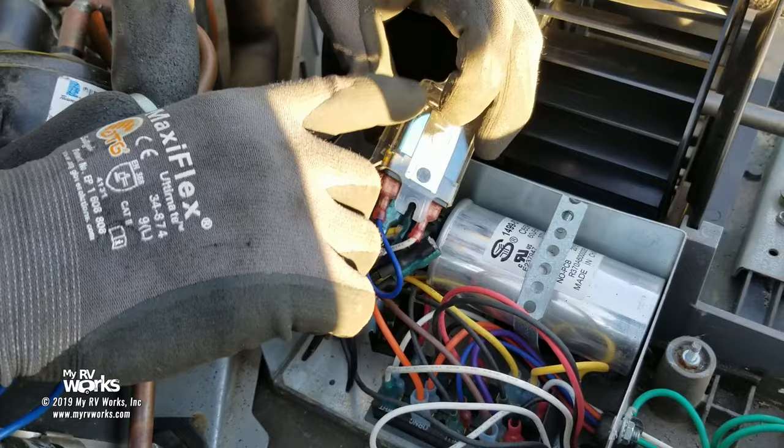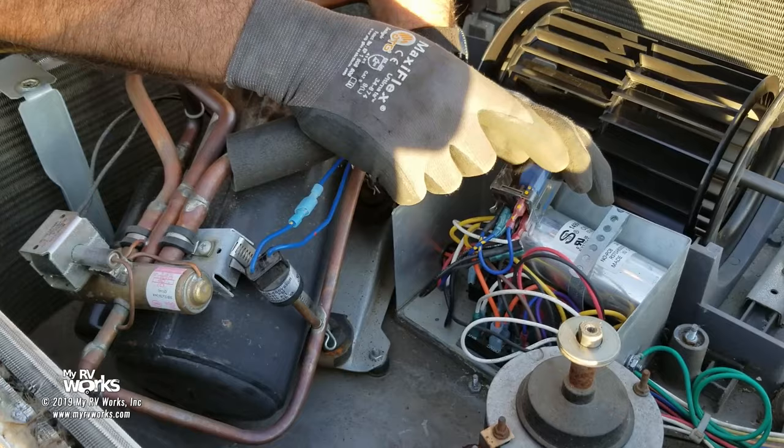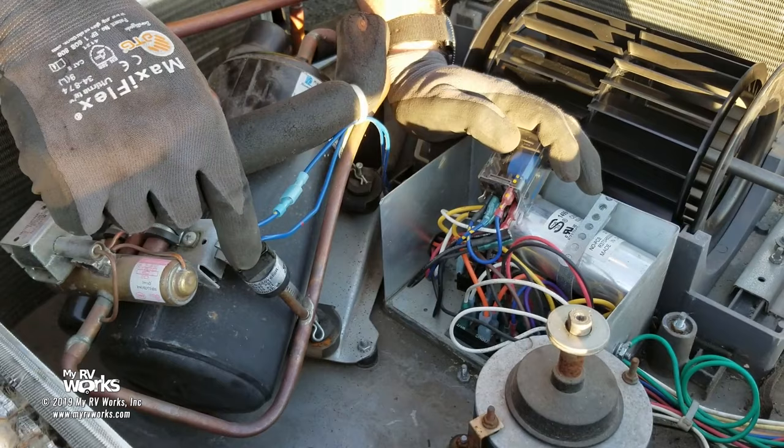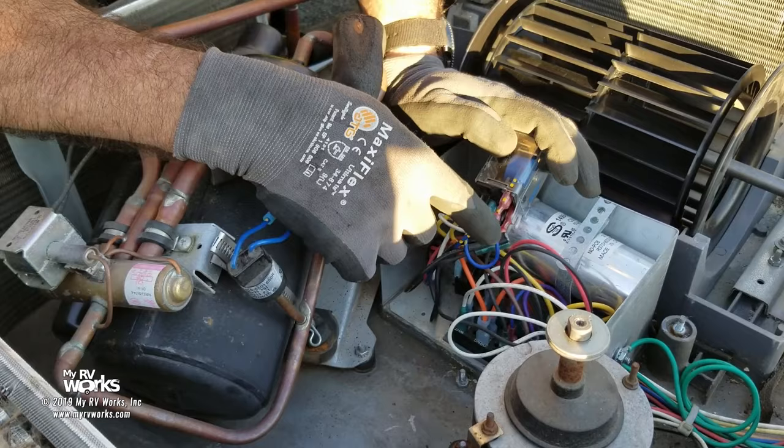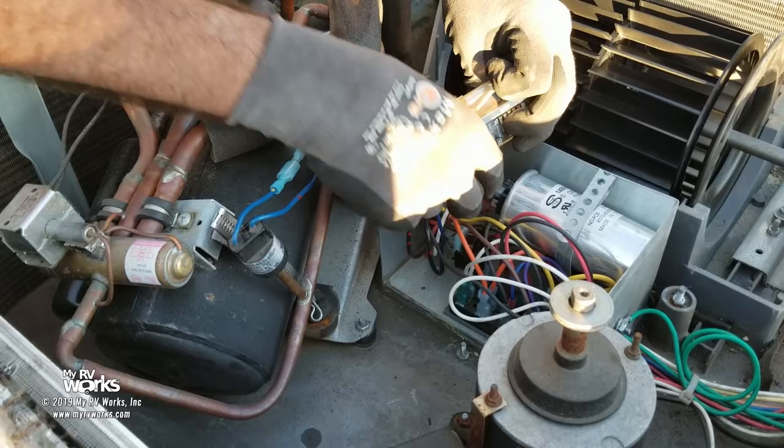So it looks like if my electricity goes through this, this relay changes states. So what controls which position my voltage is going, my relay is controlled from this high pressure switch. Okay? That's what this wiring schematic shows. So that trail ends, that branch. If my pressure is too great, my relay changes states. But let's go back. Again, he was plugged in right there. Let's go back to this.